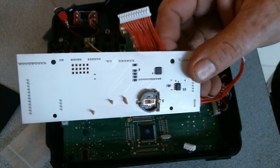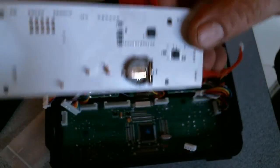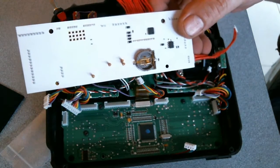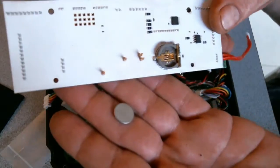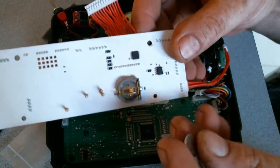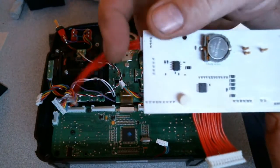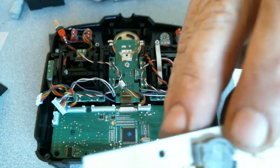What you do need to do is on the back of your board there's a slot for the 3-volt button battery, which is a CR1220. You need a CR1220 little button battery — you can get them from your supermarkets or eBay. I ordered mine at the same time as my SmartyParts board — a two-pack from Hong Kong for two bucks. Install that positive-side up. It'll take some pressure to force in and it'll snap under the little tabs.